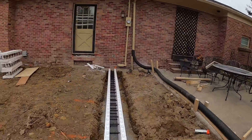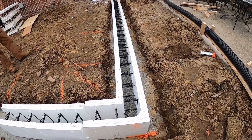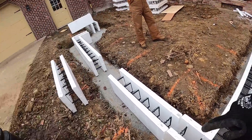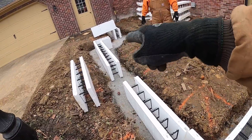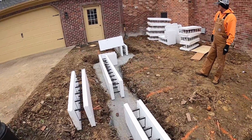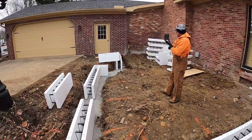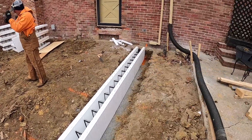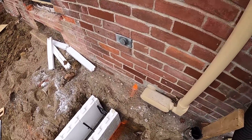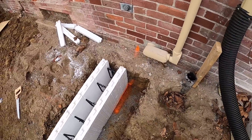Just one course out to the corner. This here is Fox Block - it's not NuDura like you guys have seen on my channel before. We've got a 16-foot wall, another 16-foot wall, a four-foot wall, and then that wall that goes over to the garage to the right of the door. This one is set - you can see the footer was a little bit away from the house, and the reason for that is there's a footer here that holds all the brick, so we didn't want to take that out.